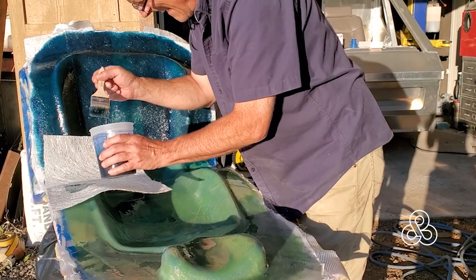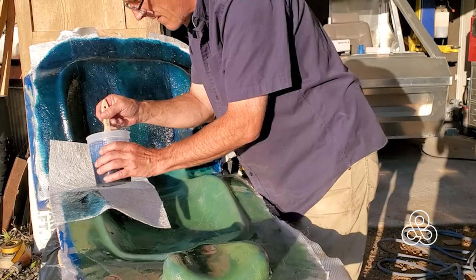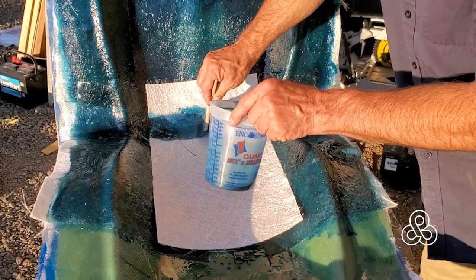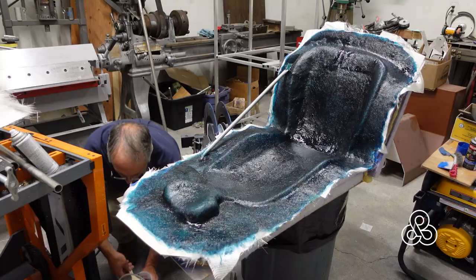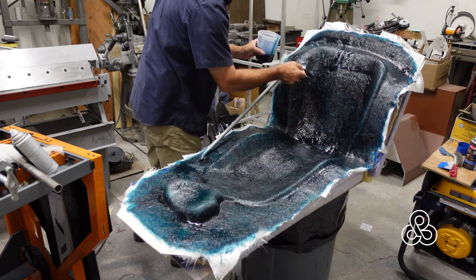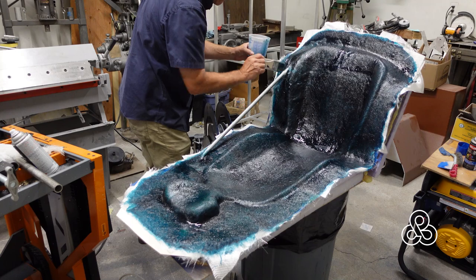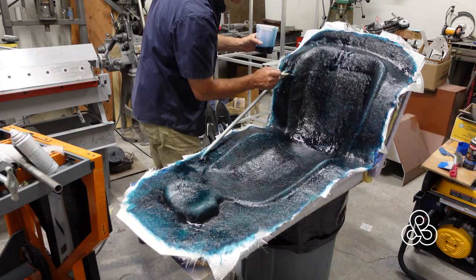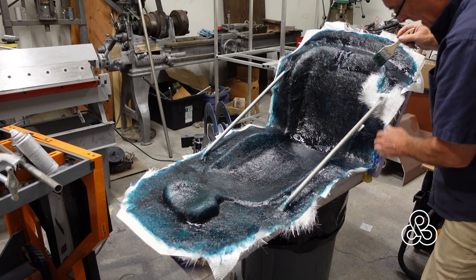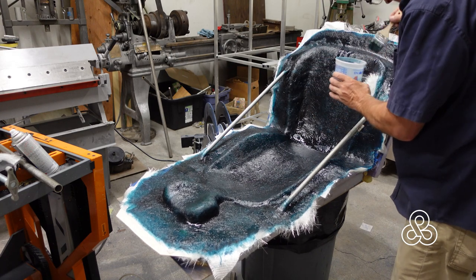And there it is with the first coats. We're going to take it outside because I hate the smell of polyester resin to permeate the shop. When you're using polyester resin, you can also use fiberglass mat, which is also very inexpensive, but it takes the polyester resin to break down the binders in the mat to make it flexible. After we've got a couple of coats of mat on there — getting that mold nice and stiff and rigid — I'm going to add a piece of tubing, actually electrical conduit, just flatten the ends out, bend them, place them up against the mold, and fiberglass them in place as well, just to make sure this thing doesn't flex. There's kind of a hinge point in the middle there where the two angles of the mold come together and it seemed to make a little bit of a bend, so this pipe will keep that from flexing at all.